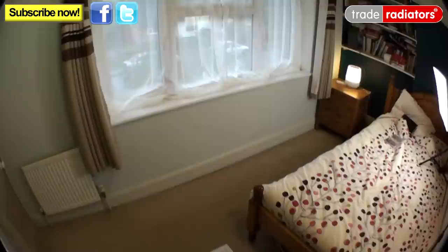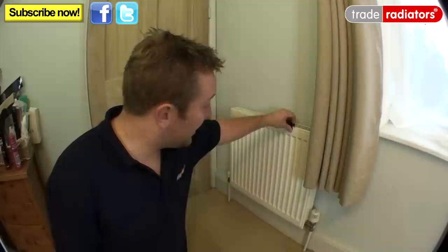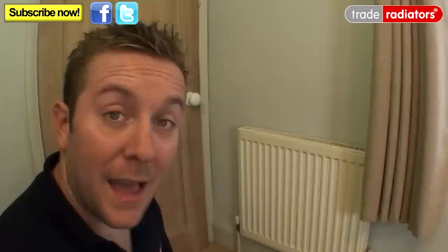The reason we try and put radiators under windows is because windows don't have great thermal efficiency, and therefore as the cold air comes in, the radiator under the window will warm that air as it comes into the room. Before we begin, make sure that you've turned off the heating system and it's all drained down. Make sure you take the magnetic cap off the radiator. Make sure all the radiator valves are open, and then we can remove this old radiator.